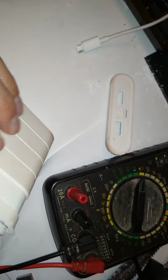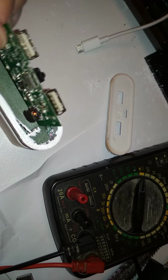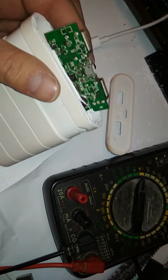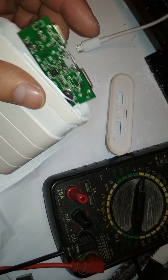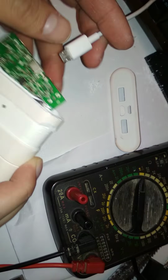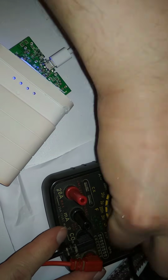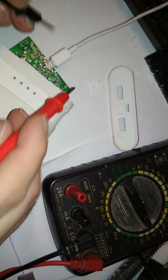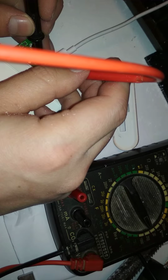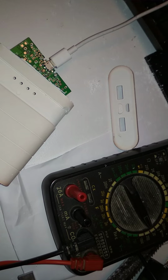Okay, kind of full of stuff. But what should we do? I mean, there's a button there. Yes. But the positive and negative are... Oh, let me measure it. Let me just plug it in and measure. So now it's supposedly charging. Let's measure 20 volts between the two points. Yeah, here's the input. And it's blinking fine. So the input is there, now that I measure it.